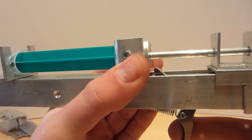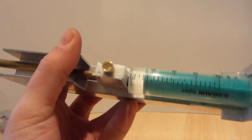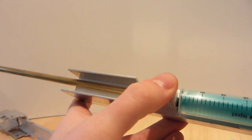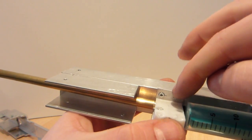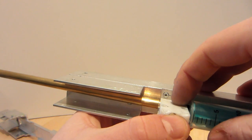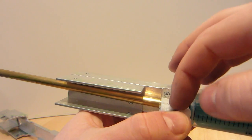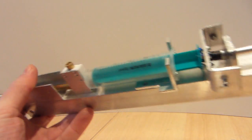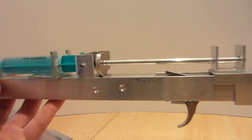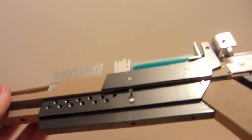When you now fire it, it releases all the pressure into the barrel. This will be plugged in the end. Right here comes a magnet holding the BB in place, and not too strong because the next BB has to fall down. And that's actually it. And now we just put it back together piece by piece and test fire it. So not yet really mounted, but you can see how it works.